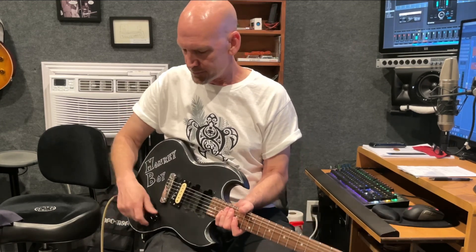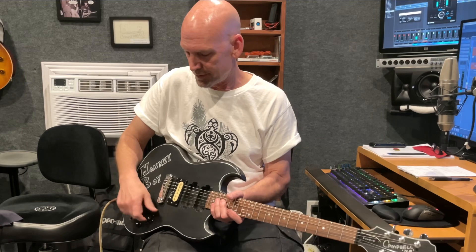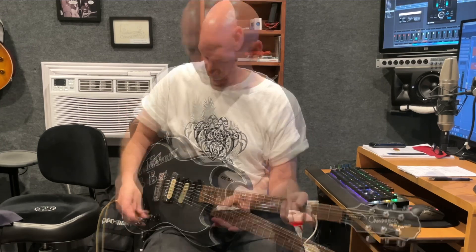So what would you do with this? For me I can put in different resistors and see what might work best. In a way, this is kind of a cool idea if you have a good guitar that's a single humbucker model and you want to explore extra tones rather than just having volume — why not have a three-way, four-way, or five-way switch? They are available on Amazon in a few different varieties; I found these four-ways, two of them for around $10. You could easily make a guitar that does a lot of extra tones. If you do a test guitar like this you may find you like something like a 6.8 in the bridge and only a 2.2 in the neck. On the Les Paul I actually went with a 3.3 in the bridge and a 2.2 in the neck — I'm super-duper loving it, it made all the difference in the world to me.